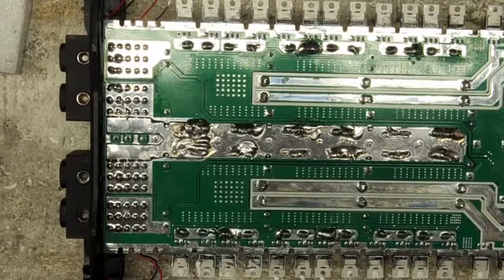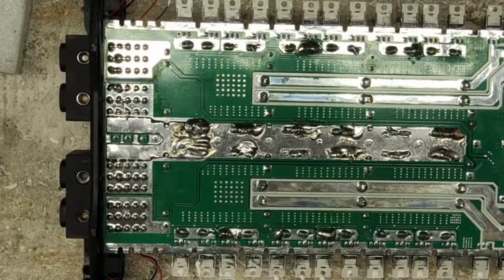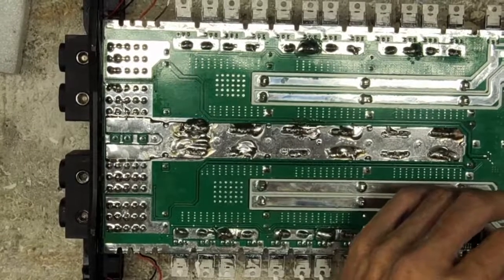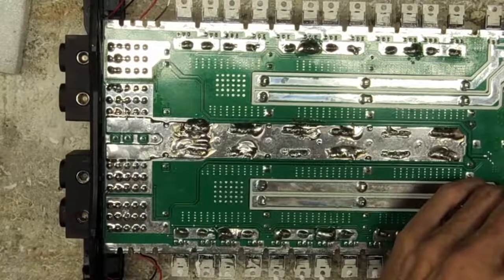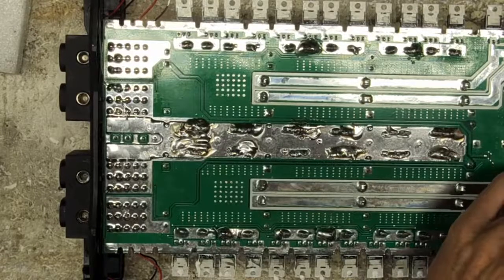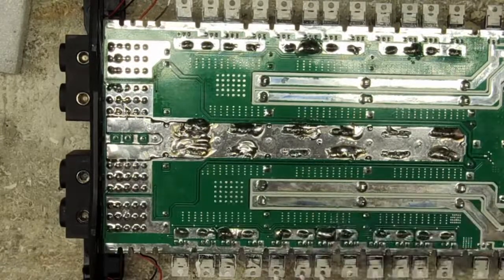Fingernails on a chalkboard, guys. Sorry about that, but I got to get this mask off. Toothbrush. Flux. Perfection. Solder. What I do is I put a little thin layer of solder on the exposed copper. I see my scalpel blade is not very flat. It's leaving some pretty good gouges.